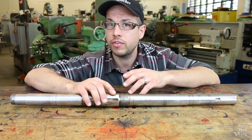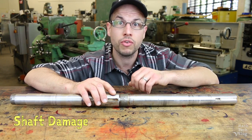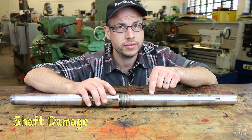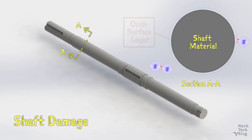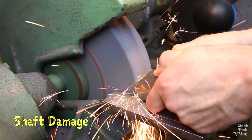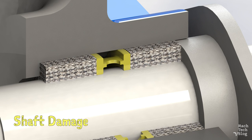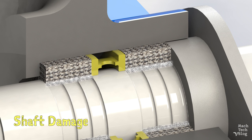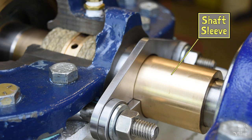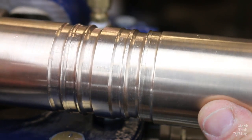Another unavoidable pitfall of using compression packing is the damage done by abrasive particles grinding against the shaft. These particles can come from the packing, from the process fluid, or somewhat surprisingly, from the shaft itself. Metals corrode to form oxides on their surfaces — whether it's iron oxide from steel, chromium oxide from stainless steel, copper oxide from bronze, or aluminum oxide from aluminum alloys — these oxides are extremely hard and abrasive; it's the same stuff used in abrasive grinding wheels. Contact between the shaft and packing causes the oxides to embed themselves in the packing rings, which then grind grooves into the shaft. Eventually the shaft will be so worn down it'll have to be replaced. One way of dealing with this is to use a sacrificial sleeve, which fits over the shaft and can be easily replaced when it wears down without having to replace the entire shaft.